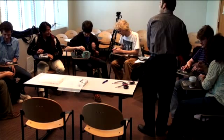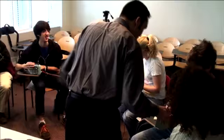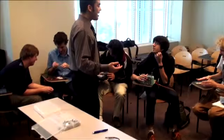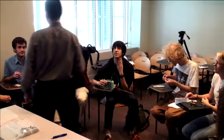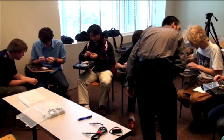Here we have a larger capacitor, which gives us some really nice low frequency tones, which I think are pleasing. Now, to get an even more pleasing tone, what we're going to do is insert a diode into the output, which is a hack that Collins uses. Somebody can explain to me why this sounds better, but it sounds nice when we run the signal through a diode. So we're going to take the output of pin 2, put it through the diode, and then pick up that output from there. And the diode is directional, so you want to make sure it's oriented correctly. Pin 2, the black end.